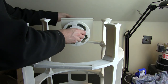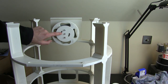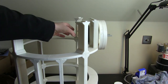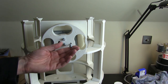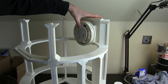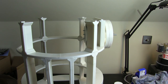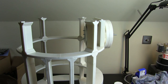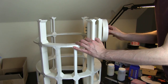That's followed by the 3D printed plate which will do up there with nuts, and that should hopefully compress both our bearings together to get rid of the noise and make it really stable. I've left the same cutouts in both the gasket and the internal wheel, and also the gasket plate, which means I can take the two pieces of fixed studding and if I wish run those all the way through the droid to the leg on the other side. If I find these aren't stable enough to hold the droid when it's upright, I can brace against the other side. Similarly, if there's too much play in the legs, I can take these three rotating bits of studding and run those all the way through. I've done the nuts up on the back and tensioned it so it's a nice smooth turning piece.